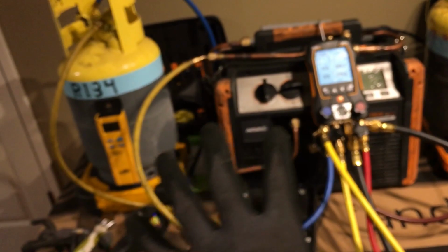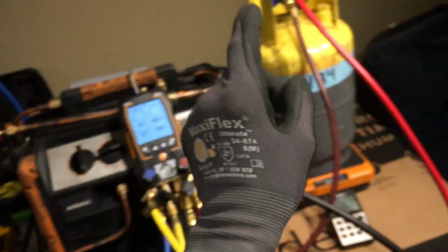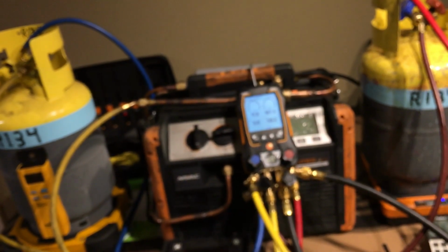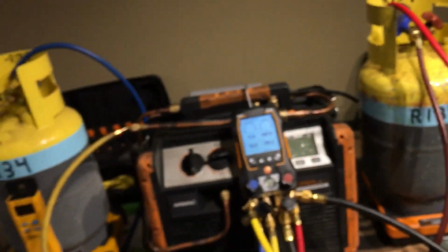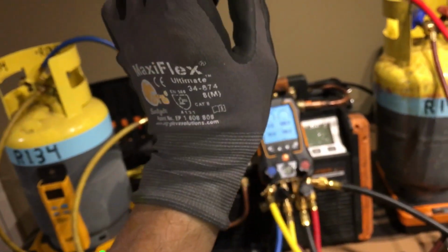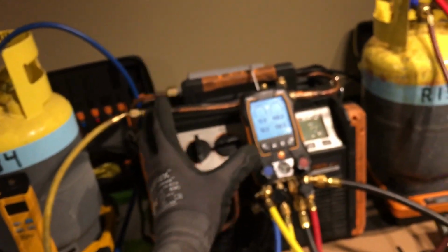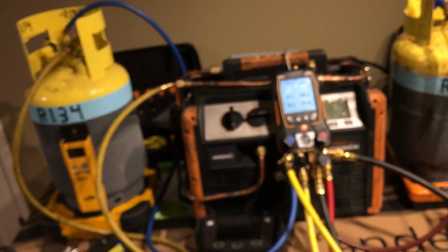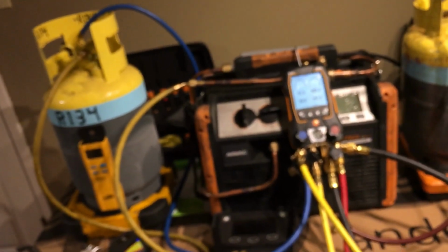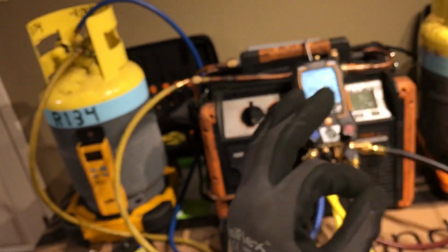So pressure temperature does make a difference. And if I had 1 drop of refrigerant in there, and I had 100 pounds of refrigerant inside this tank right here, and they were both equal temperature, but yet I had 1 drop of liquid there and 100 pounds of refrigerant here, I would have equal pressure. Pressure and fill have nothing to do with each other when you still have liquid refrigerant in the system. So if I have a car that takes 5 pounds of refrigerant, but I have 1 ounce of liquid refrigerant left in that system, I will get the exact same pressure as if that car that takes 5 pounds of refrigerant had 5 pounds of refrigerant, and they're both sitting side by side, both sitting there stagnant, and take a pressure, I'll get the exact same pressure.